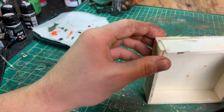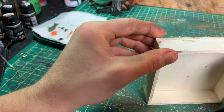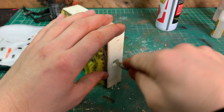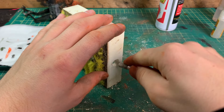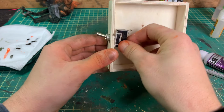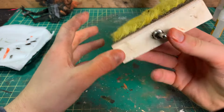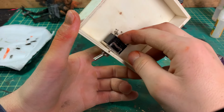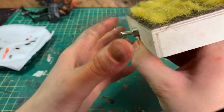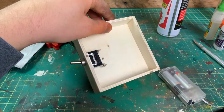And here you can see me break the plywood. Never work with a dull drill bit. That was a dull drill bit, and you can see the plywood was thinner at that point because I'm drilling the hole. So I was putting so much pressure down because the bit was so dull that I ended up breaking it. I was able to salvage it, but again, that's exactly why you don't work with dull tools. We ended up making it work.